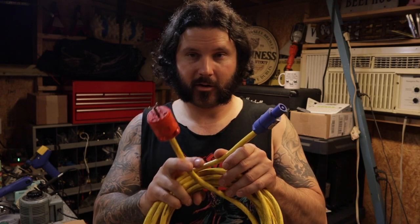This whole thing is relatively simple — you have a four-inch square box with a dual gang cover on it and a power con end. You just take an old extension cord, maybe one that's broken, which is what I did, and just put a power con on one end and an Edison plug on the other. You can buy these pre-made online for over a hundred dollars, but I've priced out what it takes to build one and even with the cord installed you're going to be making these for less than 40 bucks.